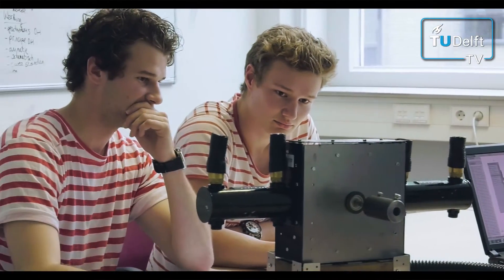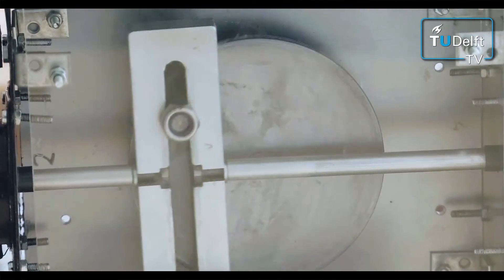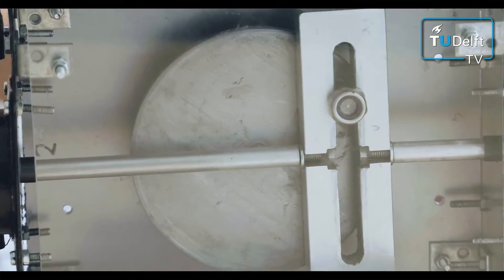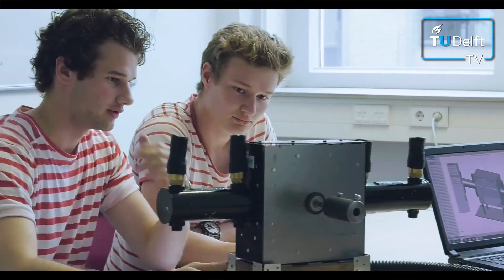We are group number 57. We made this pump. We have two pistons. The rotary movement on this side is transferred into an axial movement left and right. It's also a double stroke pump, so it not only pumps in one direction — it actually pumps in both directions, which causes a much higher flow of water.